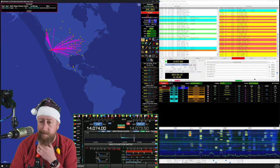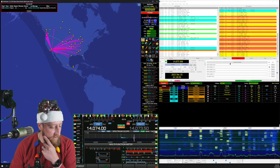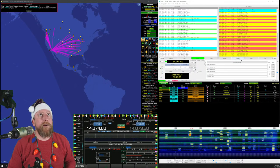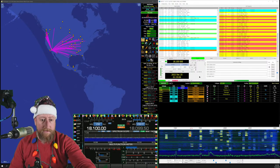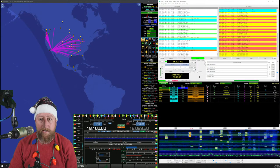Yeah, it's got a really high SWR. Why don't we, I'm going to jump down. Let's see. What do we want to do? 20 meters was okay with this initially, but it seems like we're having problems with it. So I'm going to step down to 17. And let's see if we've got anybody out there.